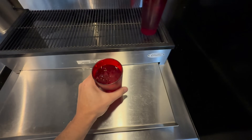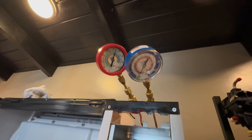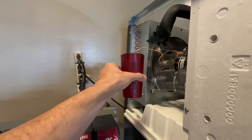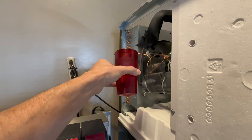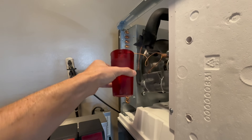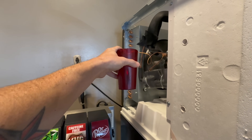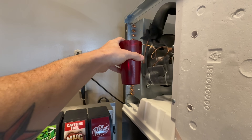I'm going to try that real quick and see what happens. Got my ice water, got my warm-to-hot water — pressures are the same, been running for about two minutes. So we're going to ice it, wait maybe 20 to 30 seconds — what that does is close down the TXV. Now we're going to warm it up. I'll try a couple of different time frames and do this a couple of different times.